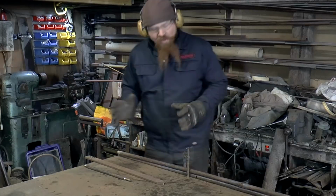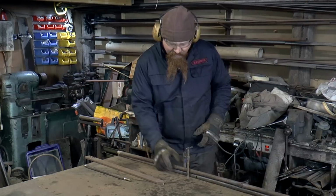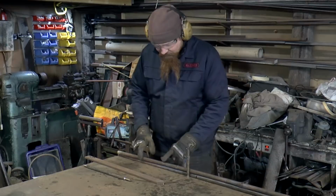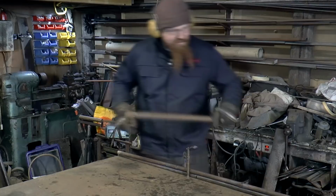Obviously I couldn't just drill for a piece of 20 round like this is made of, because this isn't 20 round anymore at this point, because these holes are punched, it actually swells out there. So if I just got a bit of raw 20 and drilled a hole through it, there wouldn't be any meat on the sides. But it does mean that when that goes through, there's more sticking out than there would be on this.